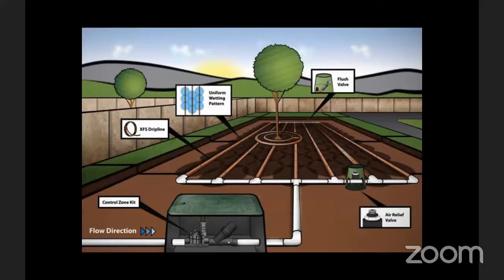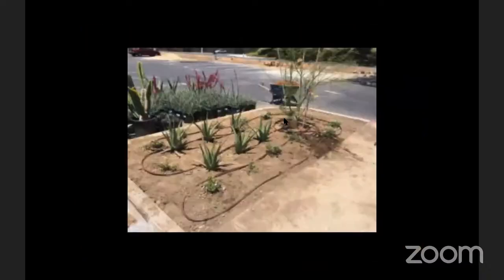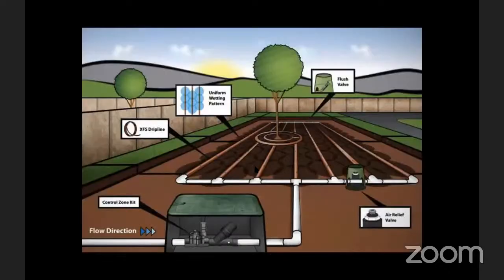Depending on the area, the amount of coverage you need, the size of the area, at a smaller size, when you connect to the underground line that's feeding it, the plastic PVC line, you can work with all of this basically half inch size emitter tube. And whether you do a more formal grid or you weave it around, you can connect it, that'll work. At a certain size, and I'll give you the guidelines later, you need what's called a header. So that's going to be a larger 3/4 inch pipe that then feeds the individual lines. And then there's a manifold at the back that can collect it in the larger lines as well. And that's just because of that same concept: you can only fit a certain amount of water through a pipe. And so at a certain point for a larger area, you need to go to a larger pipe size.